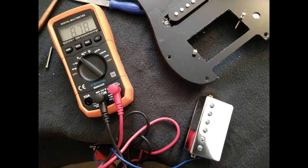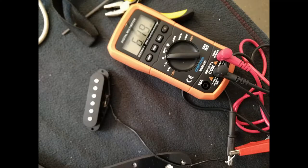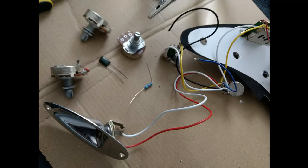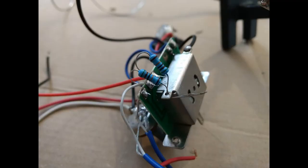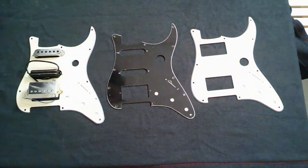I am using the multimeter to measure different pickups and find a unique setup for each guitar. I am mainly using 500k pots with their respective capacitors and resistors. I am really enjoying this opportunity to work with resistors again and learn more about them. I have to use resistors on the three-way switch and the five-way switch of both HSS guitars.